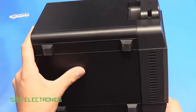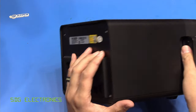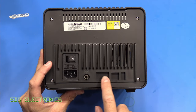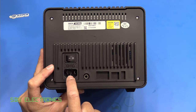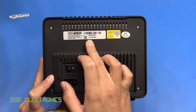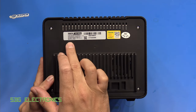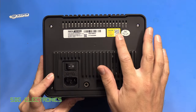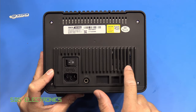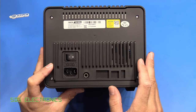And then you just screw the whole thing in with those two screws here. It's mainly made of plastic but it's quite robust feeling — it doesn't feel very plasticky, it's actually quite a nicely built unit. Then at the back, which is the only other side that has anything, this is where it illustrated there might be some connectivity but as you can see it's blanked off on this unit. We've got the mains connector as well as a hard power switch and a fuse and then just the rating plate. So no CE mark, no UKCA mark. It just says lead-free rework station, input 220 volts, 1300 watts, 50/60 hertz, 10 amps. Made in China, serial number and then just a thing to say it's an original Chinese Quick station. And then we've got a connector here for the ESD to connect it to your mat or whatever else.